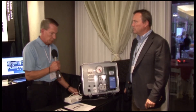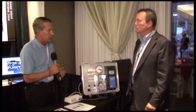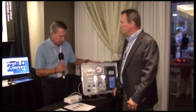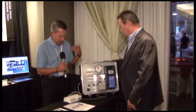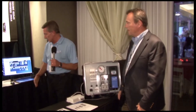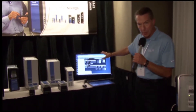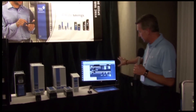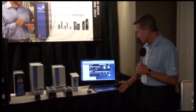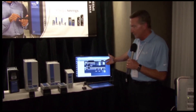We have a very nice solution here that allows us to communicate to the drive via three-wire communication, thus helping lower the installed cost and minimizing the hard wiring between the drive and the controller. This becomes a very nice sales tool to promote the product — a great training aspect for salespeople. And if I pan you around this side, here's an example of the Facility Explorer network communicating to the drive. This is actually a working system. We are communicating to our supervisory controller and controlling this variable speed drive with a simple web browser brought up with our graphic package, allowing complete control over the product remotely.